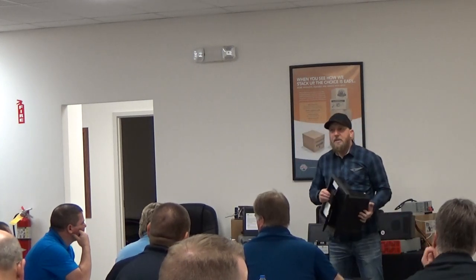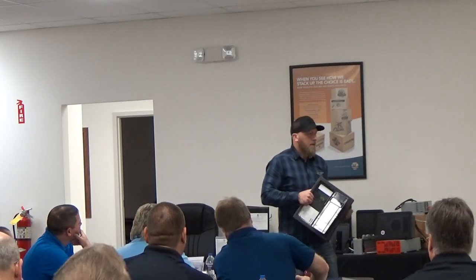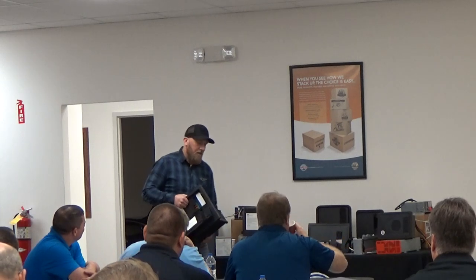And again, a lot of times you're going to find out that it's going to stem from the battery, especially people that use Interstate batteries. I'm not trying to knock Interstate, but I've got a lot of calls on Interstate batteries, and people will tell you, my battery's brand new. What I try to explain to them is, the battery could be new to you, but how long did that battery sit on the floor in a warehouse not getting maintained or anything? Just because it's new to you doesn't mean that battery didn't sit there for 6 months. There are some places that sell good batteries, and they do test them before you can walk out of the store with them. But if they go to Walmart and buy a battery, who knows when that battery got there, and you're the lucky one that got it.